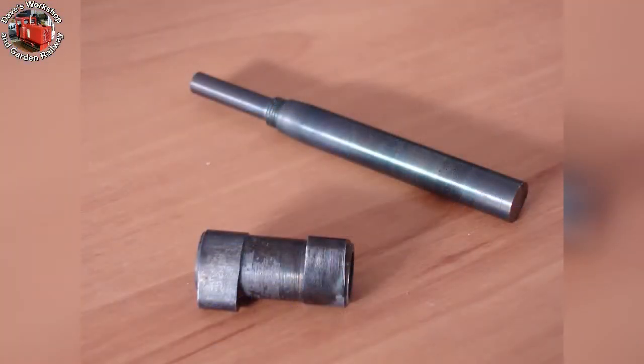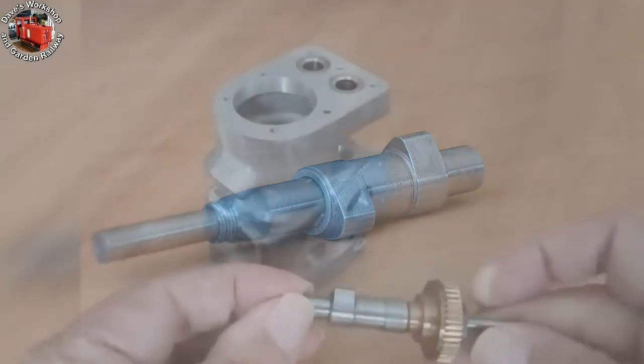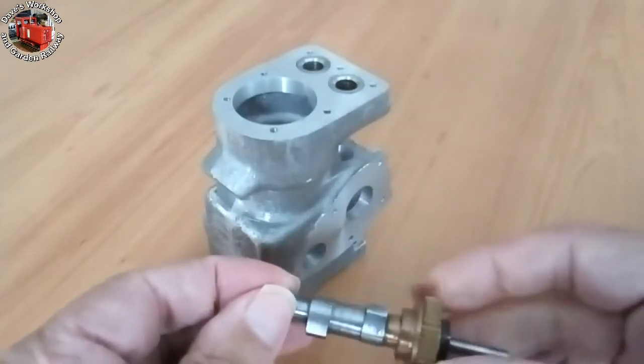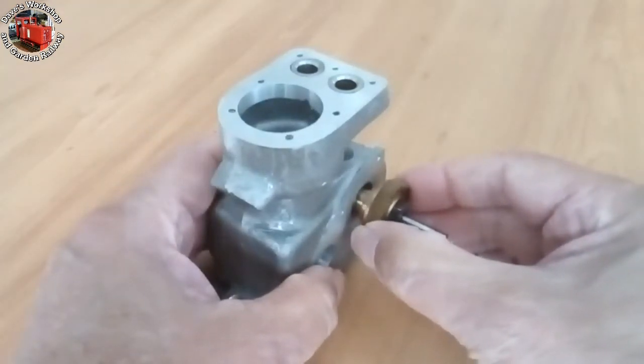I bushed the flywheel with brass to get the required length of the 10-degree locating taper. The cams piece has been removed from the camshaft and hardened, quenched in oil rather than water, then loctited together for the final time. The running faces have been given a light polishing. Here is a show-and-tell of fitting the camshaft to the main body — the bearings had been turned many years ago, along with the brass camshaft gear — all fitted nicely.